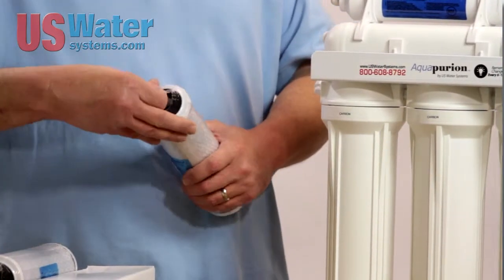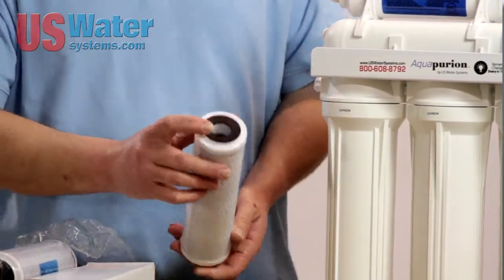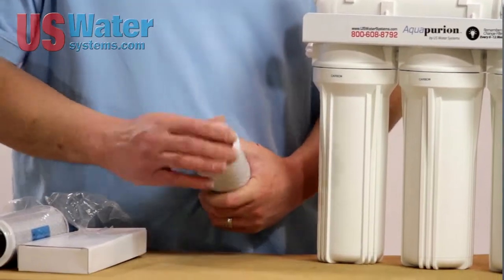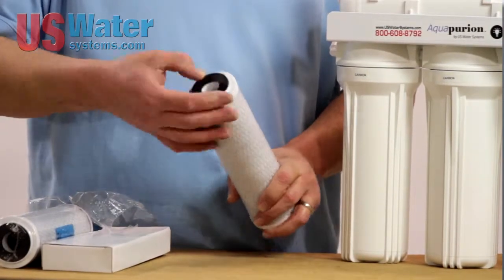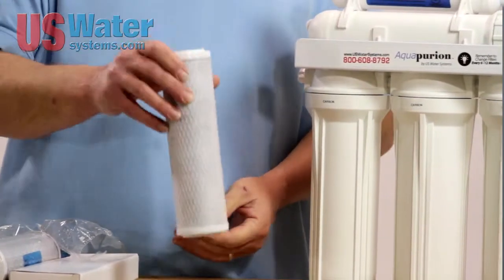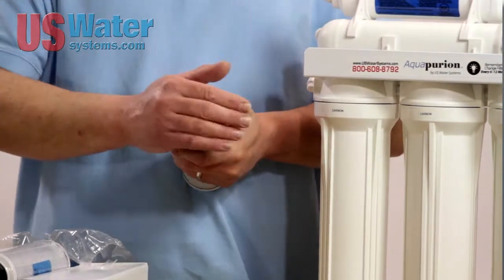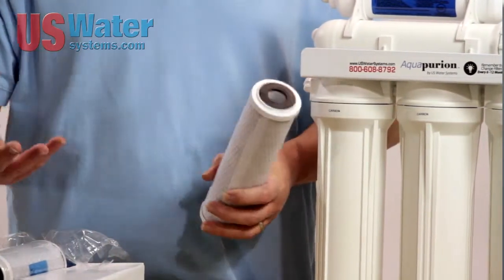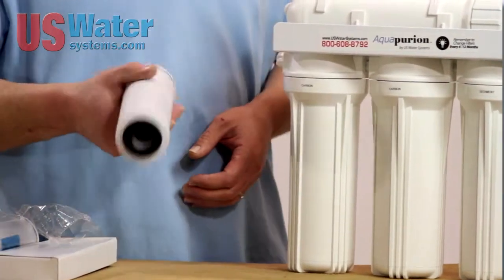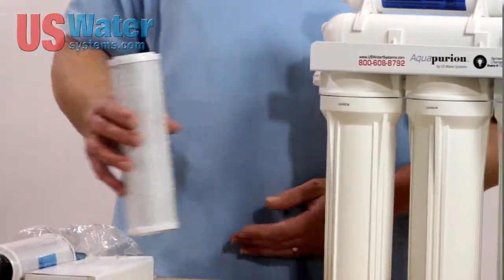On a carbon filter, it's a little bit different. It still filters from the outside in, but there are gaskets on the top and the bottom that help seal these filters. When you put these filters in, it's critical that you make sure the gaskets are in place when you put them in the sump and when you tighten it down at the top. Because if not, you're going to get water that passes right by these and it will be untreated and have chlorine. Hopefully, because they're redundant, one of them is going to have the seals and you'll have some protection. But when you change these filters, just make sure that you have these gaskets in place when you put them into the sumps.